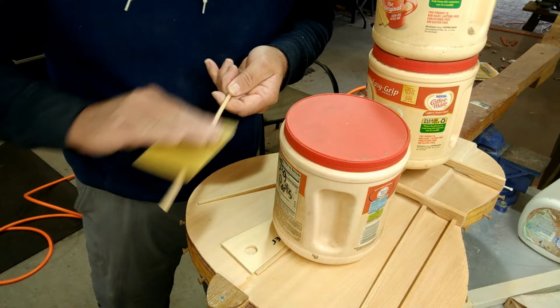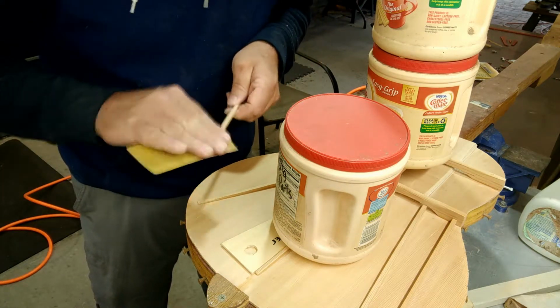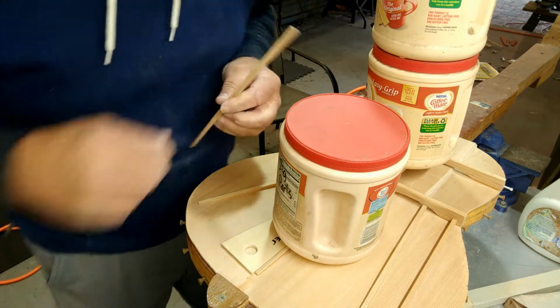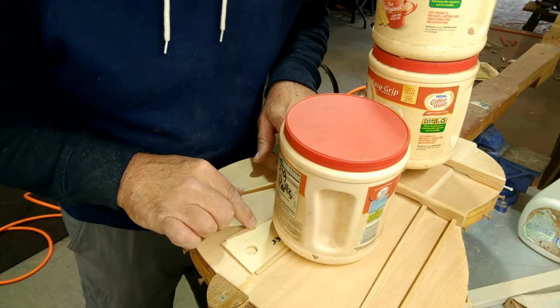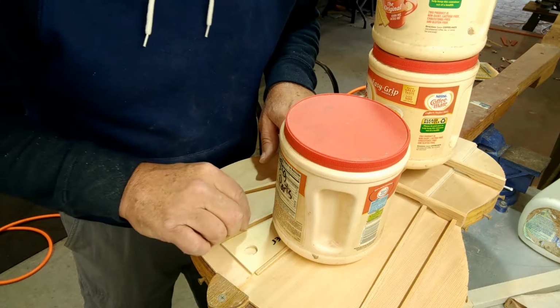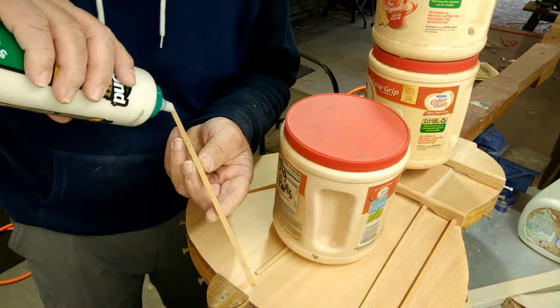I placed a fan strut spacing jig next to the center strut and used it to mark the location for the next strut. Then I dry fit the strut and cut the end of it off at the angle so that it would join to the waist lateral brace. Then I glued it to the soundboard.